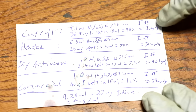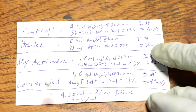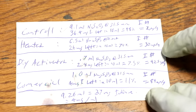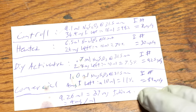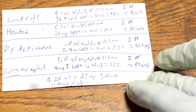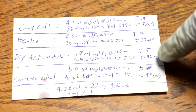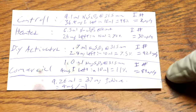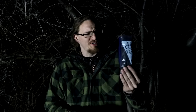Here are my results. The control — the original charcoal — was able to absorb only 2 milligrams of iodine per gram. The stuff that we heated up managed to absorb 30 milligrams per gram, which is quite a lot — that's a pretty substantial jump. The stuff that I activated with steam managed to absorb 92.5 milligrams per gram, more than the stuff that we just heated up. So the steam definitely helped. And the commercial activated carbon absorbed 89 milligrams per gram. Now keep in mind there are probably pretty big error bars on these numbers, but it still shows that I definitely was able to activate it to a level comparable to what is commercially available.